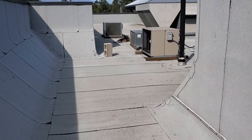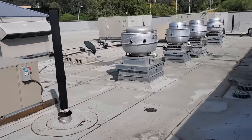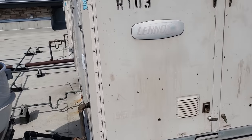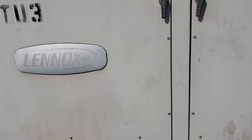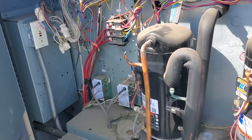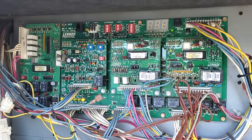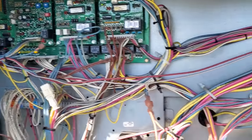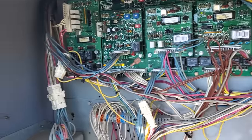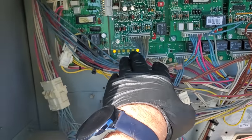Today we have a somewhat of an emergency call on a kitchen AC not working. This is my unit right here, and the thermostat is blank downstairs. Let's go ahead and open this up. We have a unit that appears to have power, doesn't look like it has any safety limits on it. We've got a call for fan and a call for occupied, but no call for cooling.